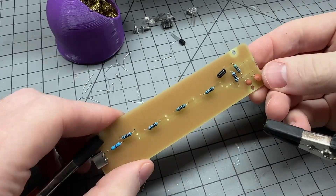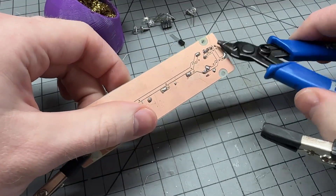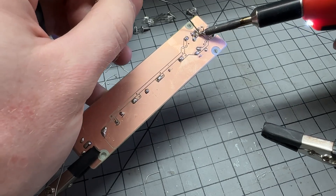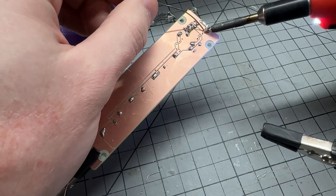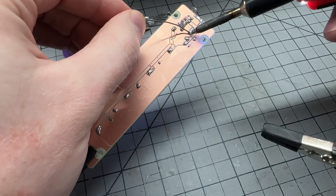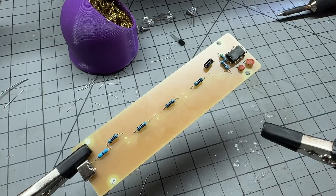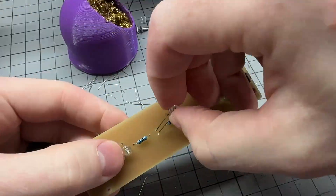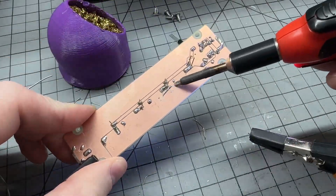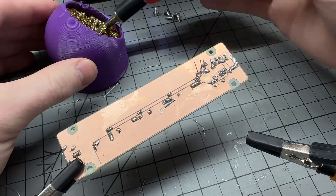Using one of the legs cut off a component, solder the touch switch jumper between the two points on the far end of the PCB — allow this to be raised as it will touch the metal button once fully assembled. Carefully install the integrated circuit so that the notch is facing the USB-C port. When soldering this chip, it's okay if solder connects between the capacitor legs and chip legs within the same row as these components are interconnected. Always clean the tip of your soldering iron to prevent excess solder, and be careful as integrated circuits are easy to overheat. The LEDs are polar — the longer leg (anode/positive) threads through the round outer holes along the bottom edge, while the shorter leg (cathode) threads through the square inner holes. Finally, solder the transistor so the flat side is facing inwards before trimming the legs and folding it flat on top of the PCB.